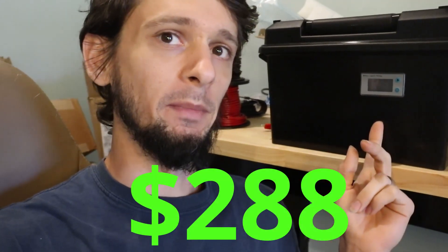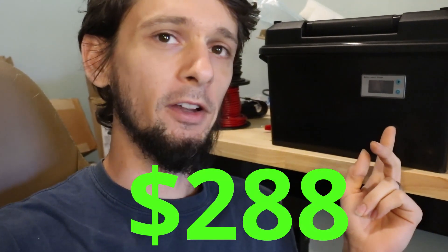This one is a really simple battery to build. This cost $288 all in — I bought the batteries on Alibaba and bought everything else on Amazon. It maybe took me an hour or two to drill holes in the case, build the battery, put the BMS on the battery, and get it all ready to charge up and test. This is an 840 watt hour battery.